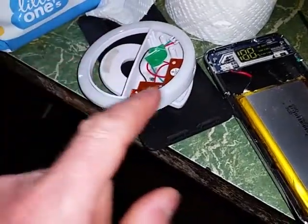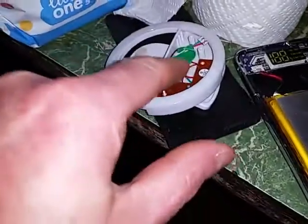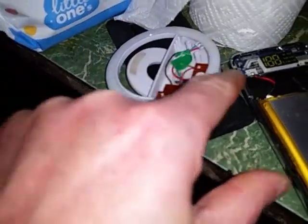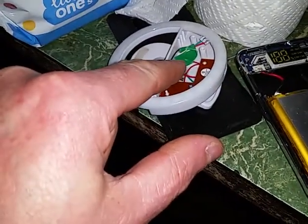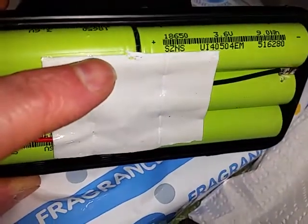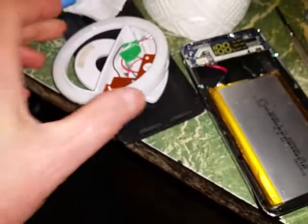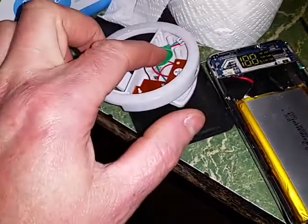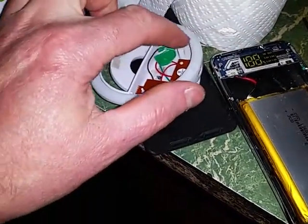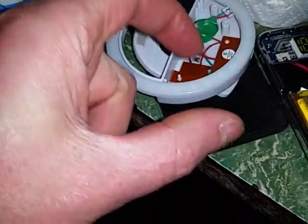But when you charge this battery, it takes, I think it's 4.4 volts coming in. So it comes in at 5, charges the battery at 4.4, lets it out of the battery at 3.7. Strangely enough, these here are your classical 18650s, which don't want to focus. There you go. It says 3.6. I don't get that. Anyway, it comes out at 3.6 and runs at 2.4 to 2.7. All of this is a couple of little chips under this and a few resistors.